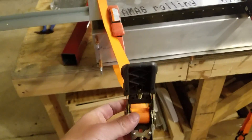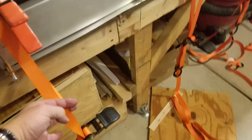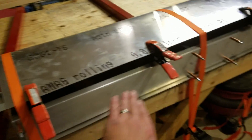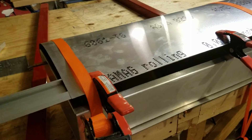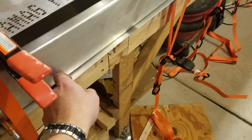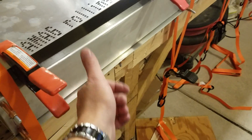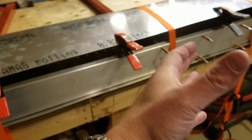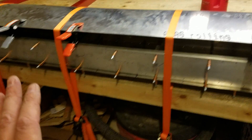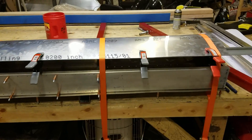What I'm gonna do is go ahead and slip tighten these - not use the ratchet as far as I can - but I've got to put a set of ten-foot two-by-fours behind them to protect the edge of the skin. Two two-by-fours running lengthwise will give this ratchet a surface to sit on without crimping the edges, since there's some overhang here that we don't want to crimp up or down when ratcheting tight.